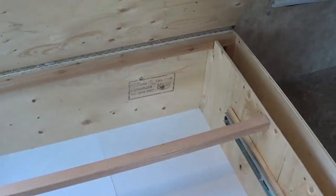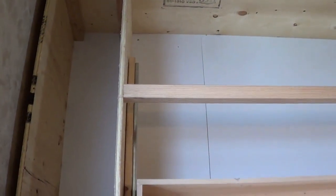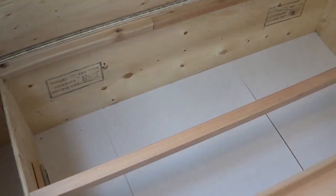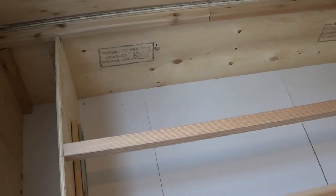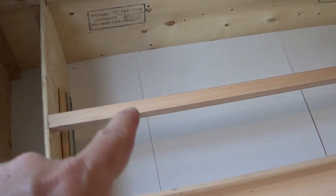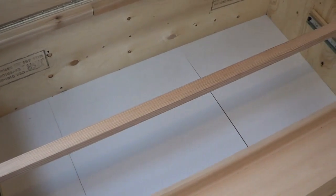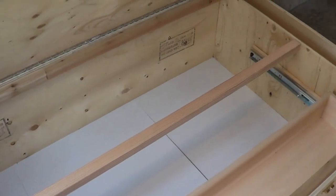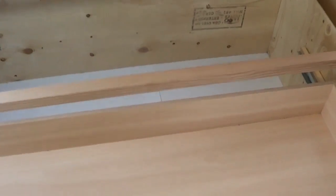And then in the bottom what I've done is I bought some thin 1/8 board, and I stapled it all to the bottom rims there, and that makes it nice inside, but it also helps stiffen up the box as far as being square. Where these seams are, I'm going to get another flat piece of board and add 2 flat pieces down there. I just ran out of lumber at this point. I'll close that up. Oh, first I'll show you.